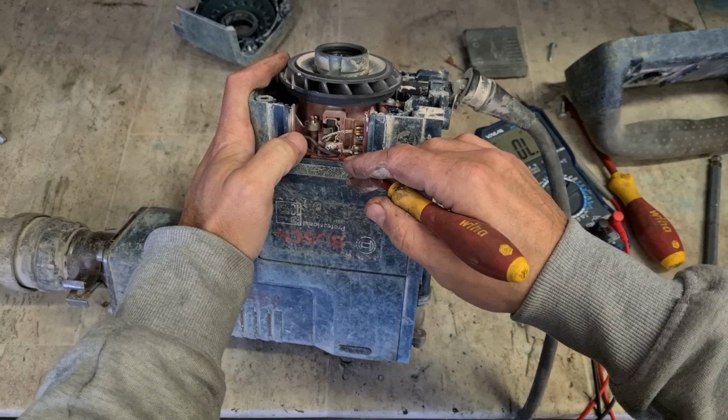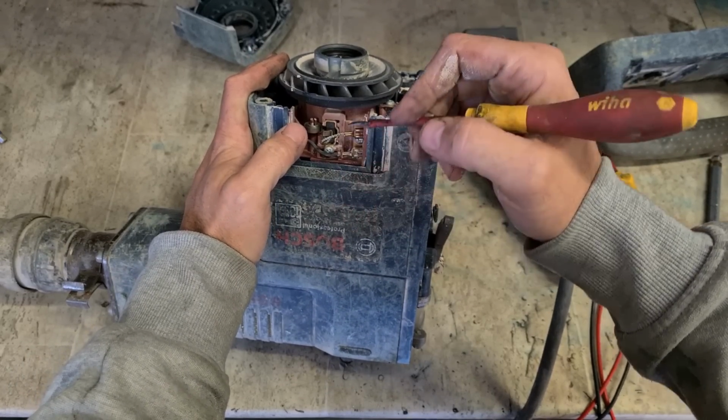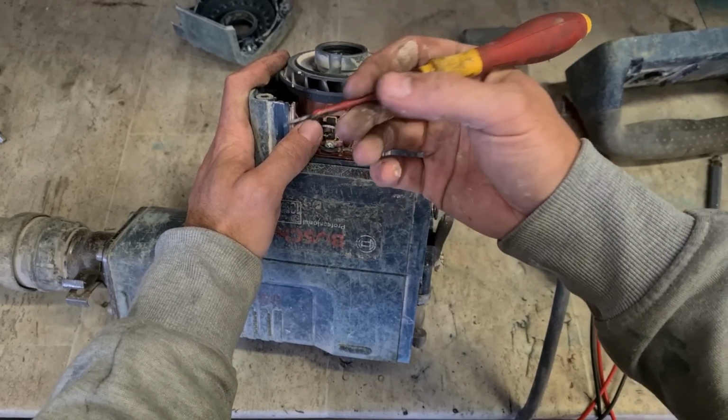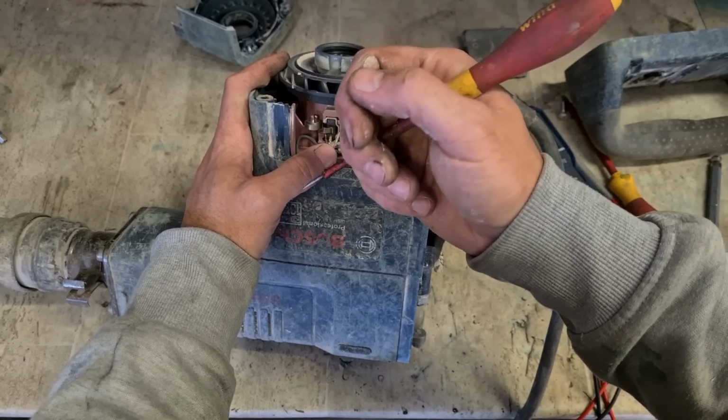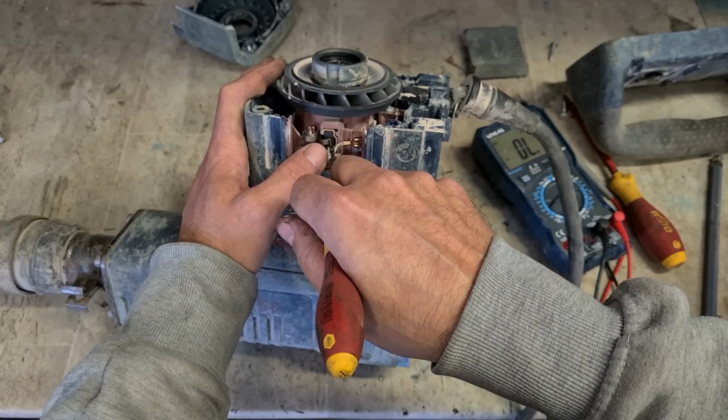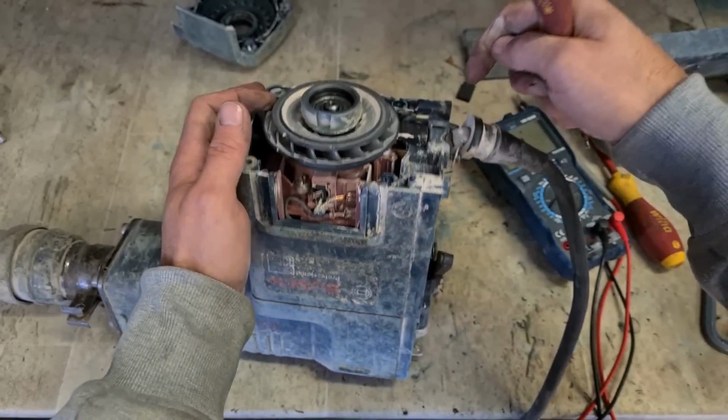What you have to do is take out that screw, pull out the brass insert, and just clean the wee ribs inside. There's actually wee fins, tracks cut onto this brass insert. What happens, wee bits of dirt or grit get stuck inside. They stop the brush going down fully.